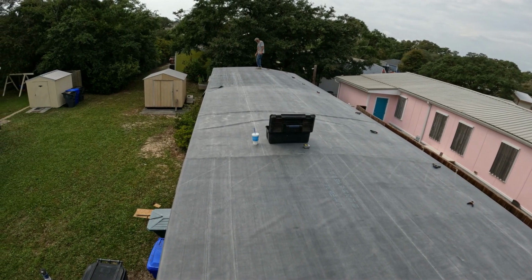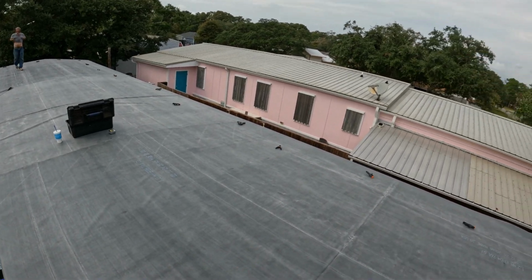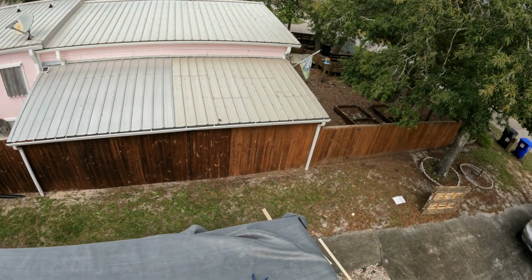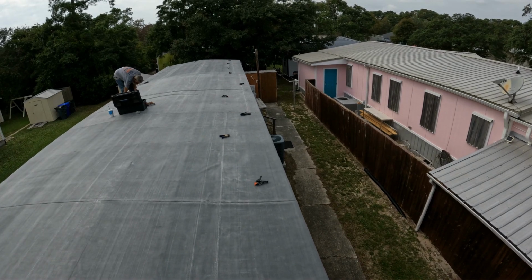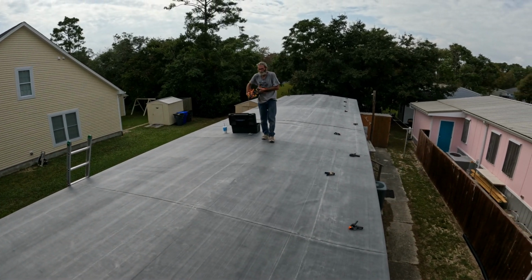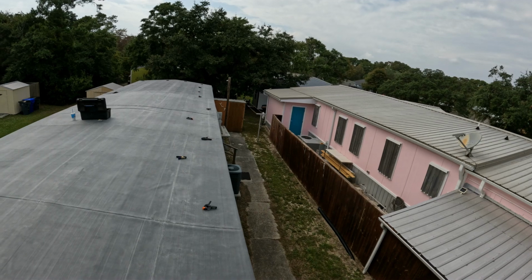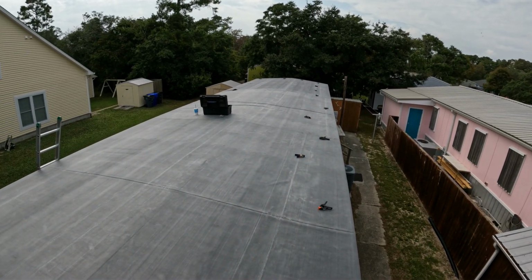So prayers, please. We're gonna clamp this thing on for the night. That's what Paul's doing. He's putting these clamps all around. If you have the same type of roof and you don't quite get it done, you're gonna want to clamp it off for the night. So plenty of clamps, make sure this thing doesn't blow up off the roof. That's the last thing you want, to have a little rainstorm and the wind pick up. You lose your rubber, it's on the ground in the morning. So clamp it all down real good.